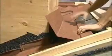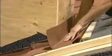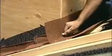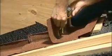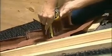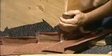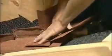Position the flashing so that it overhangs the chimney equally on the left and the right, tucked right to the base of the chimney. Mark the corners and draw a parallel line 2 inches out, and mark a horizontal line 2 inches up from the bottom. Cut these out, and you'll end up with a flap that wraps around the chimney, with a little bit of flashing that extends 2 inches past the corner.